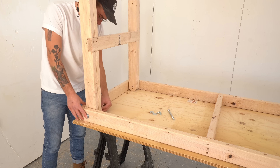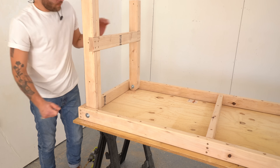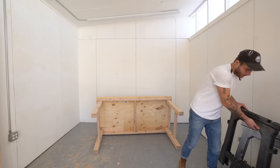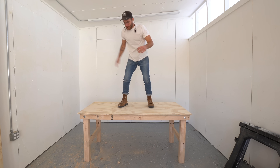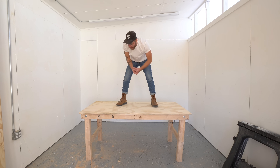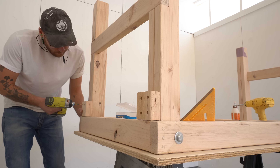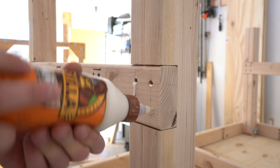It would have given me a little bit more wiggle room, probably without reducing strength any. Once I used a wrench to tighten down these legs, they were locked in. I just hopped up there and tested the wiggle and it was minimal — definitely good for building. I don't think I'm going to need a stretcher between the two legs; that feels really sturdy. Instead, I did add stop blocks on the tops of the legs so it had a positive stop at 90 degrees before I locked everything in, and I figured this would help with racking a little bit.